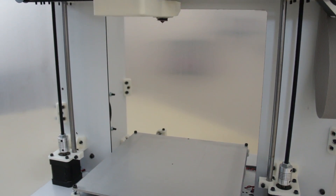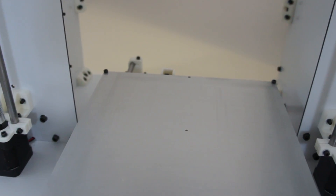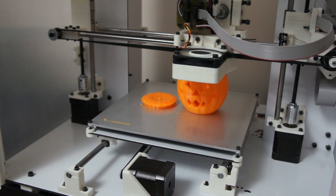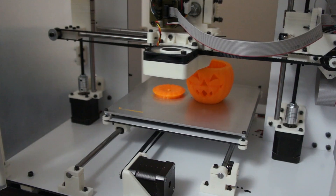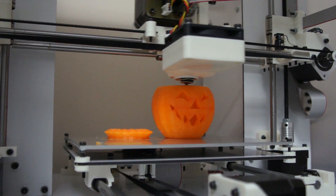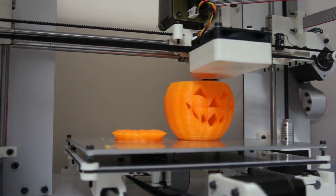This is the second Mendel 90 I've built and it's now my primary machine. Inside I have a Mark III heated bed — a standard PCB heated bed but with 3mm aluminum cladding on the back, so if you run it upside down you don't need a piece of glass. I'm trying to reduce moving mass on the Y axis to print faster, so I've just gone with a hairspray surface dressing, which works fine for PLA. I haven't had great luck with ABS, but I also haven't tried ABS with the new enclosure, which might help quite a bit.